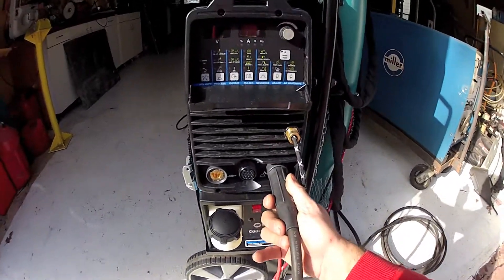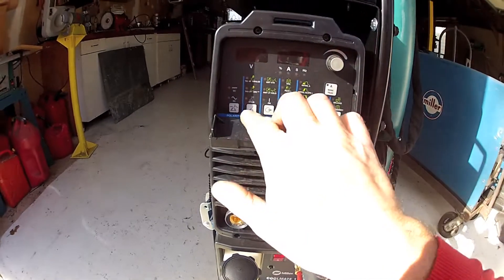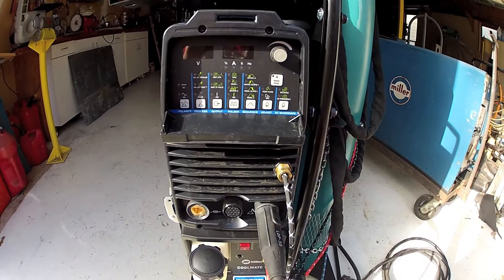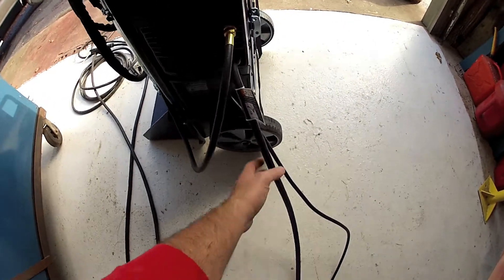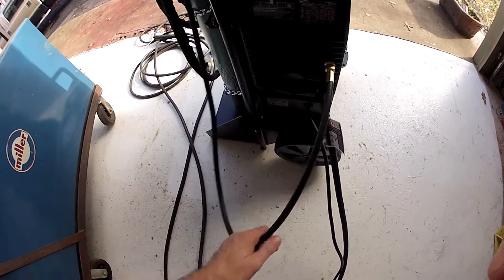The stick machine process is pretty straightforward — it's simply a matter of turning the machine on, selecting stick, selecting output to on, and setting your amperage. That part's really simple. The TIG side of it, not so much. The back side of the machine is fairly straightforward; the instructions for hooking up the electric are actually quite easy. Pick the two leads — or three if you have three phase — and plug them in. The gas plugs in conventionally in the back.